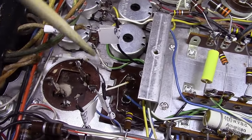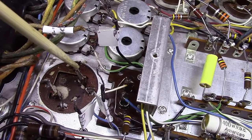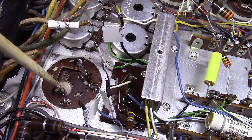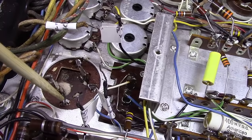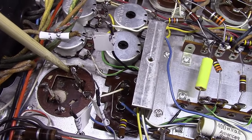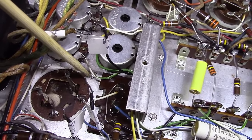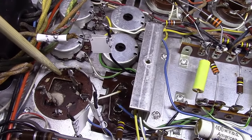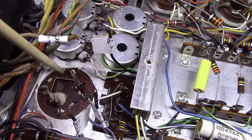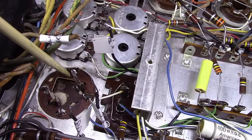First off, if you'll notice, none of these ground lugs right here, nor the actual positive connections to the capacitor, the two different ones, nor this ground lug, nor this one, nor this one. All four of these, which go actually to the outside of the can, none of those are actually chassis ground. If you'll notice, it's got this little wafer here that when you mount it keeps it separated, so that chassis ground is separate from the actual capacitor ground here.